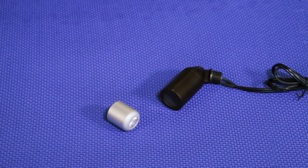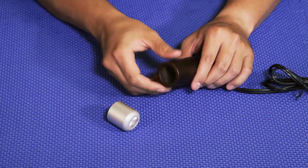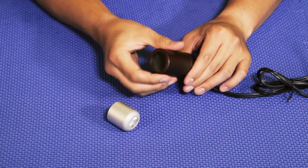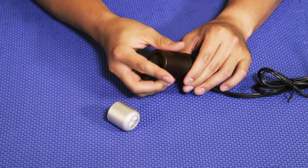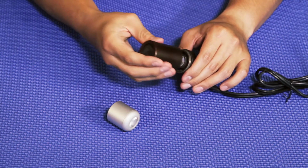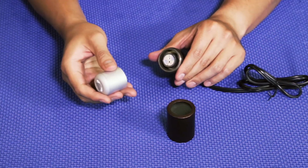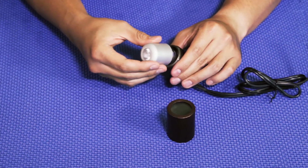In sealed fixtures, there's a higher rate of hot air accumulating inside and around the plugs, and that's why we've introduced the integrated series light plugs. You want to keep no more than 1 millimeter between the LPH body and the inner surface of the fixture so that the heat can effectively transfer between the two solid surfaces.